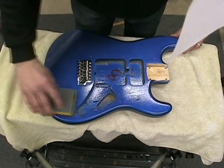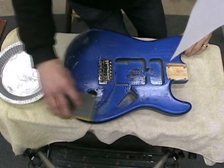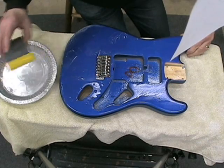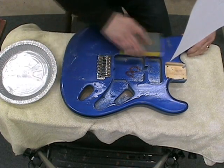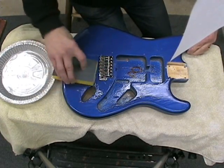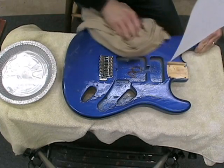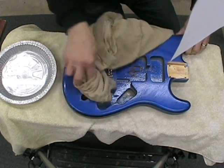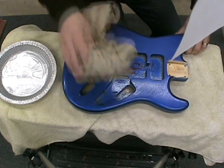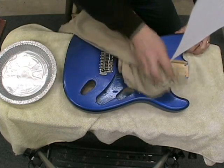I'm going to go through and start the sanding process. While I'm sanding, I'll occasionally dip the sponge back into the water, which helps keep the suction going. I've been sanding with the 1000 grit for about 5 minutes now, and I'm going to wipe it clean to get a feel for how the surface is coming along. Some of the major bumps seem to be getting fairly level, so I'm going to switch to the 2000 grit.